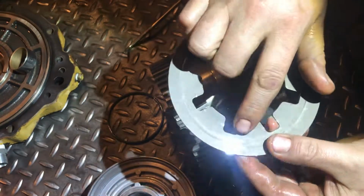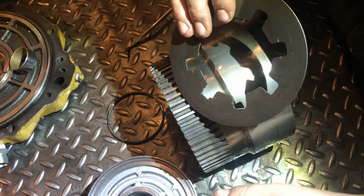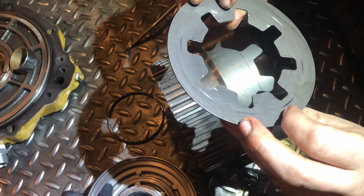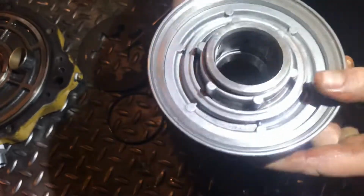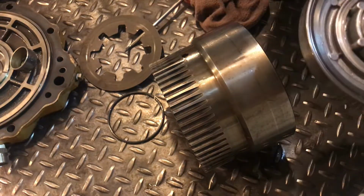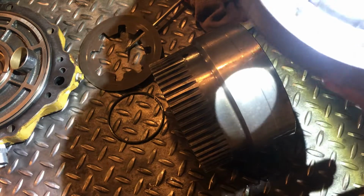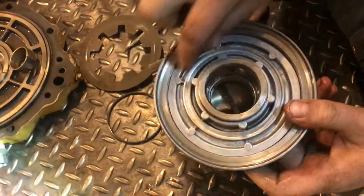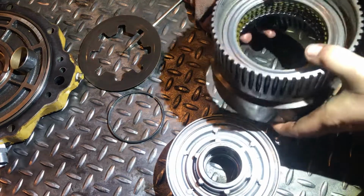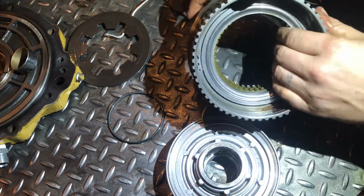So what's interesting here is these little wear marks right there, and I'm almost wondering, is that because the snap ring came out that this pushed too far, potentially, and it deformed it too far the other way? Oh yeah, and we got some O-ring or something sticking out. It looks a bit torn. Could you grab the rubber tipped blowgun? We'll see if we can pop this piston out. But yeah, so this larger diameter O-ring here is the one that I damaged putting back together. I nicked it with an O-ring pick. So it looks like that snap ring is still in place.